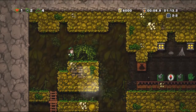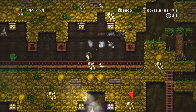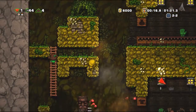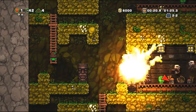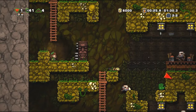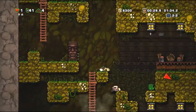While I'm waiting on the paint to dry on the sink, I came back down because these panels are now fully glued up. I made one, a duplicate, and a shorter one for the other side of the room, but they're all basically the same. I need to clean up the outside faces using the planer, but it's a little too wide, so first I'm going to run these through the table saw to get them down to the right width, then take them through the planer and get both sides really smooth.